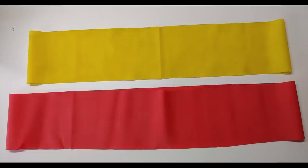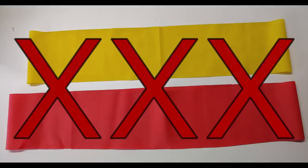The first thing we looked at was the belts we were using. Exercise bands were not going to work, they just couldn't hold up the candy and the amount of weight that would be put on them. We needed something that was more sturdy, but we also wanted something that would create a lot of friction. The friction is what helps the drive shaft grab the belt.